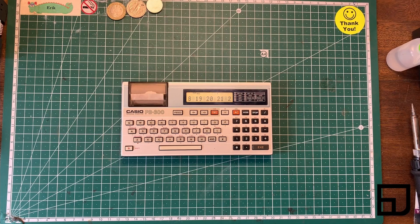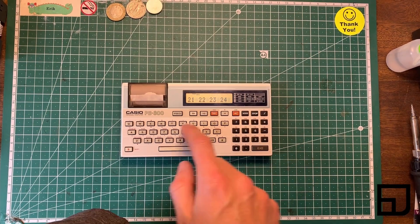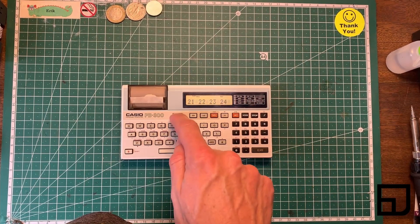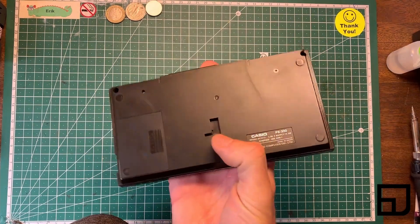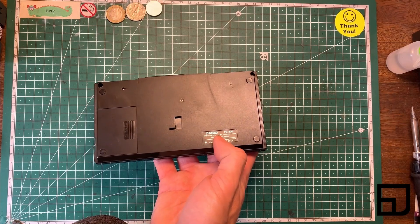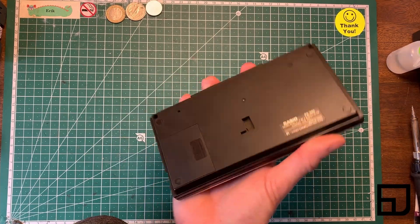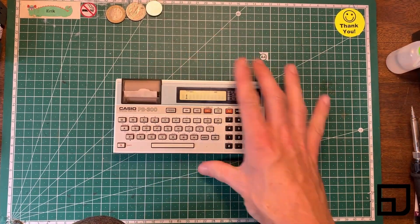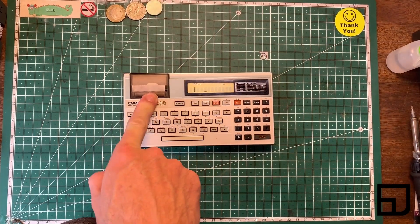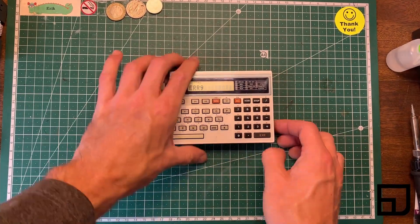It works pretty neat. The only issue though is the printer. Make sure the printer is on — mode 7, printer came on — it doesn't work. If we look at the back there's a power rating for 3 volts times 2, or a 4.8 volt power supply, which is akin to some NiCads in there. It says charger, so there's some internal batteries. I'm assuming that's what's going to drive the printer since the coin cells aren't going to give enough power. So let's pop it open and have a look.